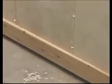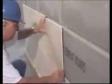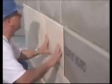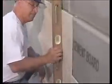Installing the veneer onto the substrate is quick and easy with Lat Epoxy 310 Stone Adhesive. Begin by installing a ledger board if necessary for your first course, making sure it is secure and level. Set the veneer onto the ledger board or lower course stone using the proper spacers. Lat Epoxy 310 will allow you to compensate for variations in veneer thickness or variations in the substrate by simply pushing or pulling any side or corner of the veneer. Use a level to make sure the veneer is plumb — once plumb, no further adjustment is necessary. It's that fast.